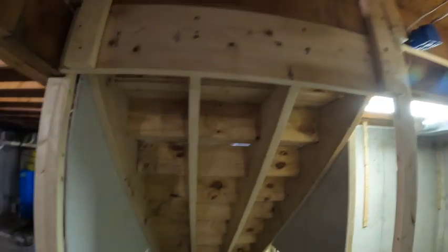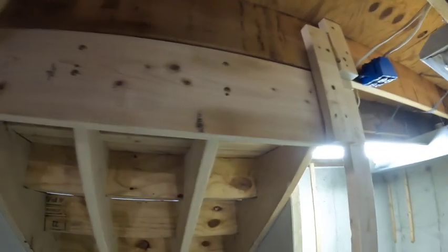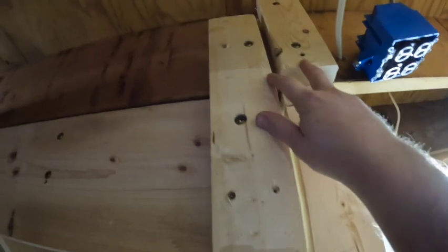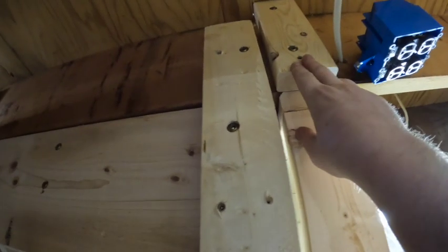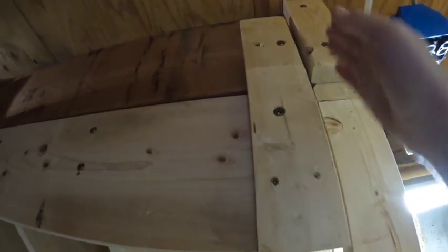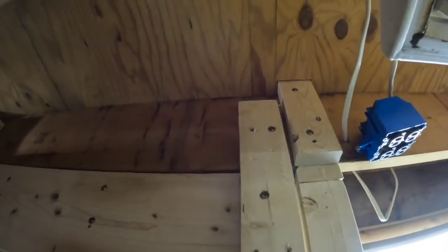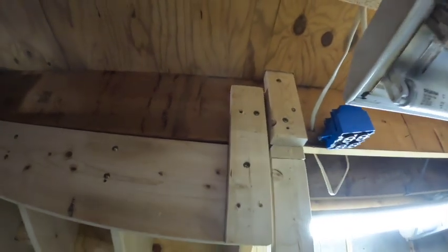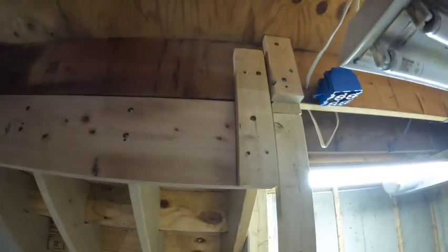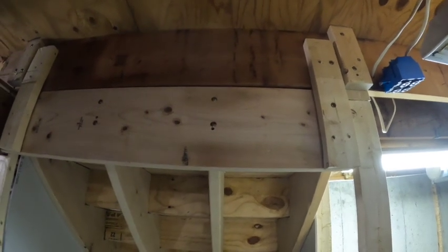These are my stairs. And this worked out really well. So I brought these down. These are all GRKs, structural lags. These are the posts that go up through the floor and support the banister walls above. And those are super strong and solid. Those can be challenging to get to be really solid if you don't have access into the level below them. There's different ways you can do it.